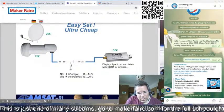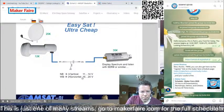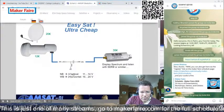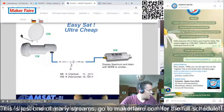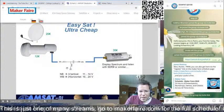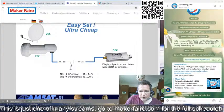You also need a power T to supply 12 volts to the LNB, depending on its polarization. The satellite uses vertical polarization, so we supply 12 volts. This can be built from scrap components. You then connect the RTL dongle to your computer.